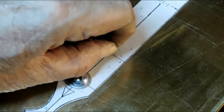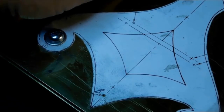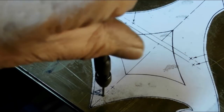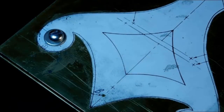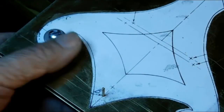Yeah, okay, I got my finger on the bottom here. I can feel it going through, so that's a good fit. And we'll just go finish the other hole off down there. So these will be our alignment pins. Give it a couple of twirls in here, finish it off. All right, put these pins in here, and then I'll clip them, and a couple of taps to hold them in place, but let's get a look at them. There you go.